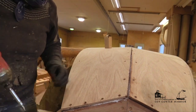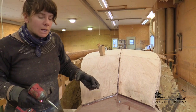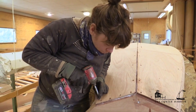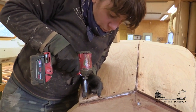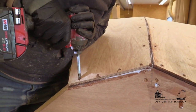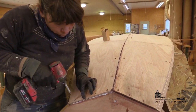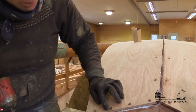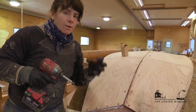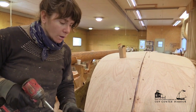You might find that your transom screws are spinning a little bit, and that's because you're essentially going into end grain. So in this situation, we're okay, we're getting squeeze out, should be fine. What I did do is drill with a bit slightly shorter than needed, and let the screw kind of fill in the rest. And you do have a little bit of room. I've used 7/8 here, but if I felt like they were spinning out and not grabbing the way I wanted them to, I would probably have enough room to do a 1-inch screw there without it coming out